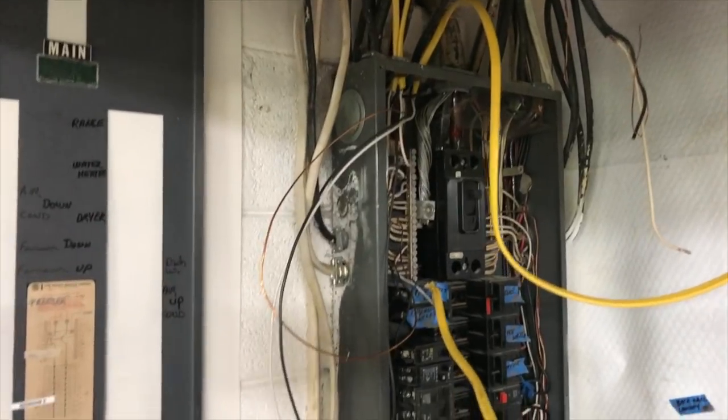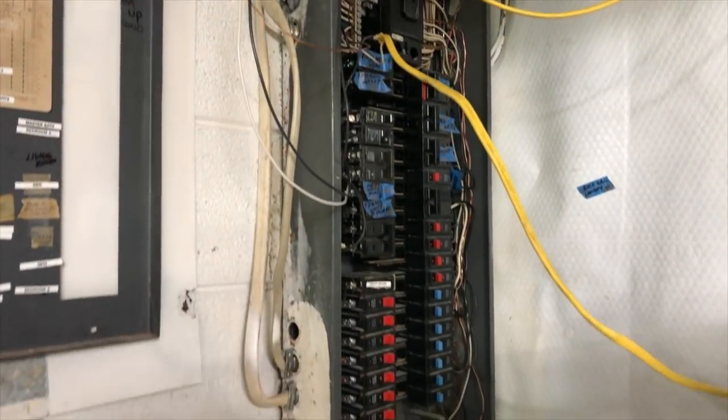One thing we don't have in here is enough electricity. I got bogged down in rewiring the panel. The panel is very scary here. I actually had 30 amp circuits on 15 amp wire. Let's just say big fire hazard. I had some circuits in the house where I had two breakers on one circuit, so even if you shut off one breaker, the other one was still keeping that circuit live. Really just kind of slowed me down a little bit on getting this wired, and then we started traveling again.